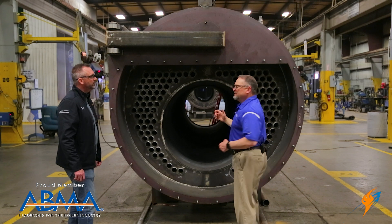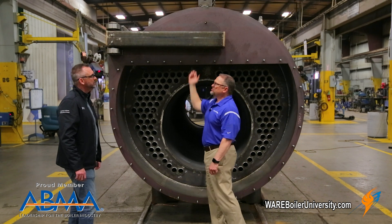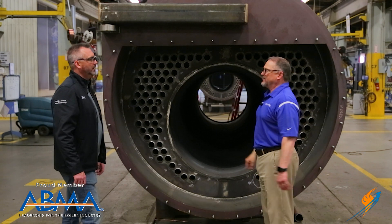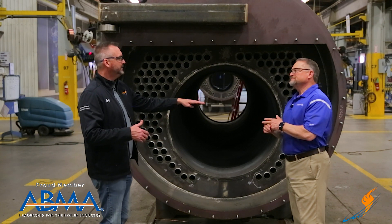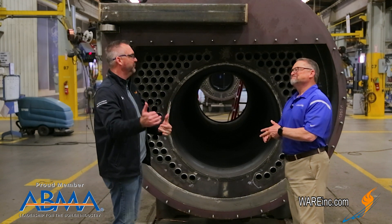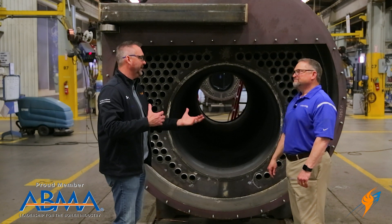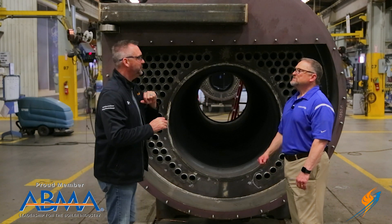No droop is critical — if you're one person trying to close the door and you don't have this support structure, you'd need floor jacks or an overhead lift to bring that weight back up and set it in place. With a rental boiler, the trailer is off the ground, and in the old days we'd need forklifts. Now literally one technician can open the boiler up, which is much better for the customer and for our technicians on site from a safety standpoint. I think we're moving on to stage three — let's go.